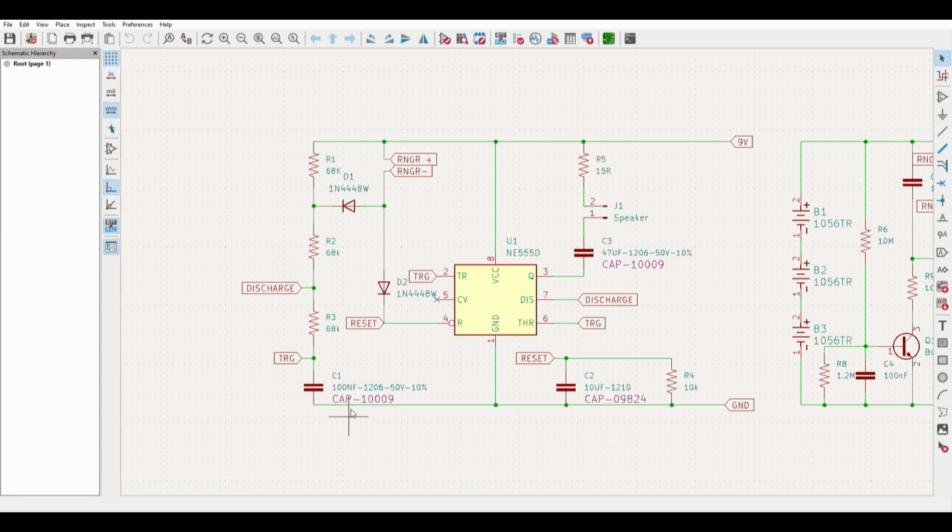But at the same time this is happening, C2 over here is being charged via D2 here, and actually allowing it to wait to play its part. This will happen when you release the push button. Now, normally when you press the push button, only a quick press is allowed. But generally speaking, you press it, you get the ding, and then when you release, you get the dong.